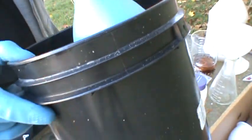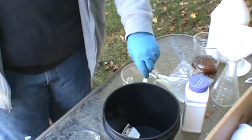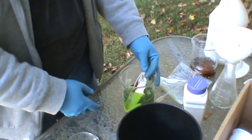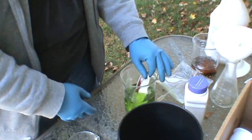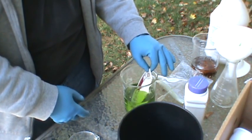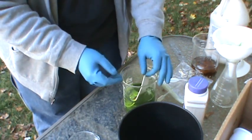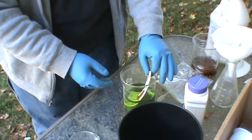It's all in solution. So what you're going to want to do is put those pieces in a bucket, because you're going to want to rinse them off. That gold is in solution, so some is going to be stuck to it. There's not a whole lot of gold on these things, but if you have a whole stack of plates, I think it's worth it. Always make sure you use protective gloves and protective eyewear. The fumes from this are pretty nasty, so make sure it's a very well-ventilated, breezy day.